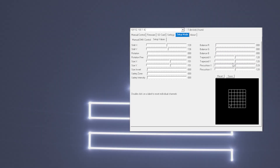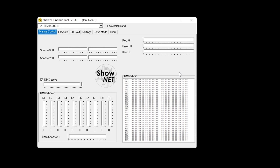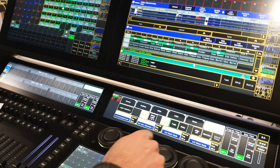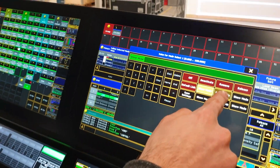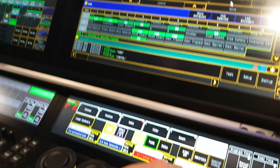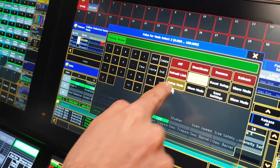The laser can be safely operated in stand-alone operation and even in DMX and ArtNet mode. A great advantage of the SHONET laser mainboard is that all output-related settings can be made with the admin tool software or directly via DMX or ArtNet. You can write back the settings and store them in the mainboard with DMX and ArtNet alone, which makes a computer superfluous on the production site.